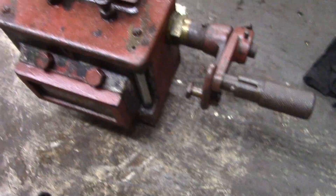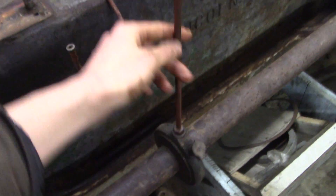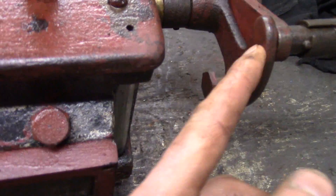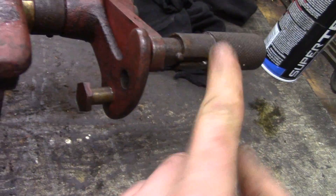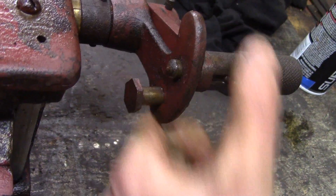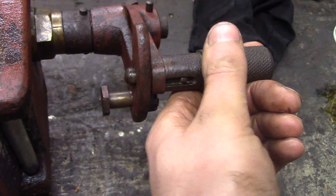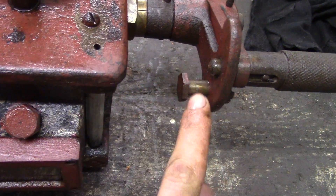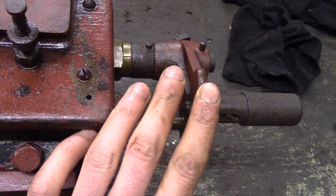On the outside, the way it is operated - it operates off of the side shaft. There is an eccentric here and this rod attaches onto the oiler. That rod is bolted on with this shoulder bolt. This other hole here engages this handle - you can see it - this handle is spring-loaded and it clicks into place. In this position, this handle is directly connected to the lever that operates the pump, and as the engine's running it'll be moving the rod up and down, working the lever and pumping the oil pump.